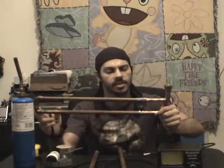Now, some people are probably scratching their heads right now going, hey Fox, why in Sam Hell is the coax shorted out on this? And the reason being, this is what we call a closed-loop dipole. Originally, when we were doing the Wi-Fi stuff, I only really mentioned what we call an open-loop dipole, where you only have a wire going one way and then the other on the feed line. The reason we have a closed loop is we use this for an impedance match. By adjusting where the short on the wire is, or where the feed point will be, we adjust how much impedance, and thus standing wave ratio, will be on the feed line itself.